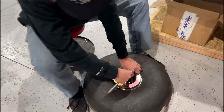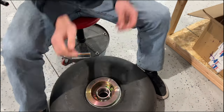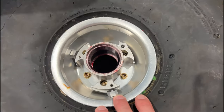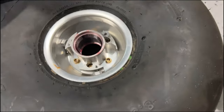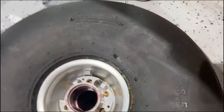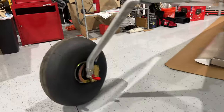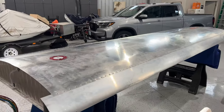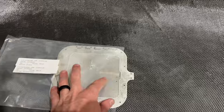Got my helper Colton here. I forgot you've got to take off the rotor right there to get at the bolts we're trying to crank down. Reviewing my old video was helpful for the torque value — 100 inch-pounds on those. We deflated it, got the little spacers in too. That went really well — happy to have those installed. Now we can load up the plane with whatever weight we want.